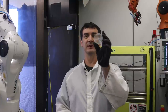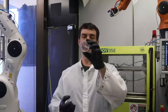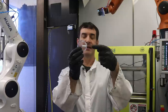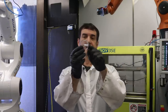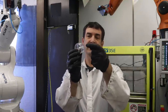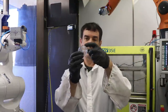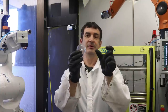So this week we have another customer job, and we're going to be molding this polycarbonate cylinder with a funnel shape. It also has a side core pull, which is a hole that goes from the side of the part to the center through hole, which would be done by a steel cylinder, as well as a threaded port, which needs to have a screw that screws into the mold, squirt the plastic, and then unscrew the core out. So it's a double side pull.